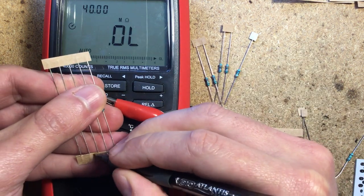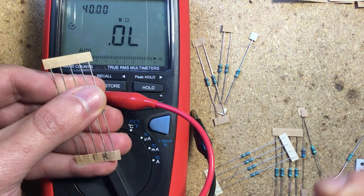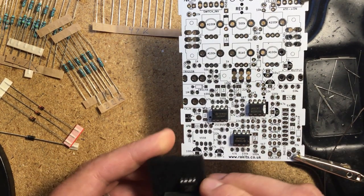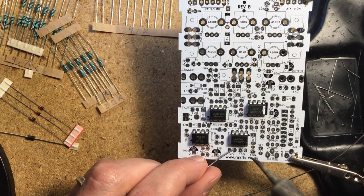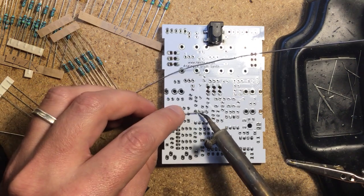I just soldered them on without sockets, since I was very sure about the position due to checking with the build guide. But if you get sockets, do use them. The only advantage I found for not using sockets is that I can solder some of the leads from the top, which holds the ICs in place when I turn the board around to solder the rest.